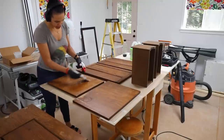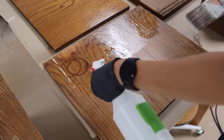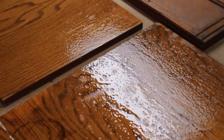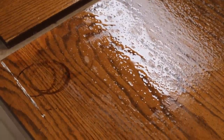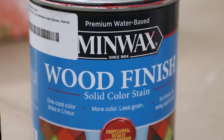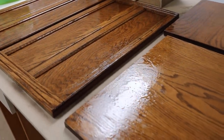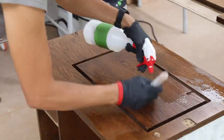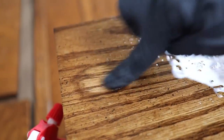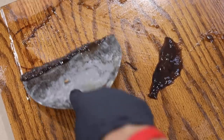The next step was to strip as much of the old finish off of this sewing cabinet as possible. I did put on a couple coats of stripper, allowed it to sit for about an hour or two, and then I removed all of that nasty old top coat and did some sanding. The reason why I did this is because the product we're using is the Minwax Wood Finish Water-Based Solid Color Stain. This actually provides color like paint, but it keeps the wood grain visible so that you can actually see the texture. With oak, it has this deep grain in the wood, and that's what we want to uncover.